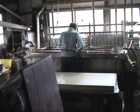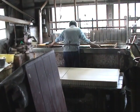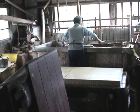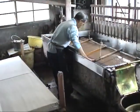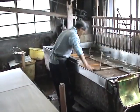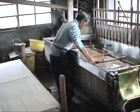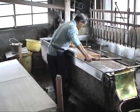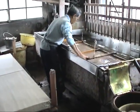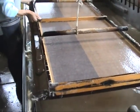Many Chinese papermakers have told me there are 72 steps in making paper, from selecting the proper trees or shrubs in the forest to the final bundling of the finished paper ready for market. In between are the myriad processes that include stripping, soaking, cooking, beating, sheet formation, pressing, drying, and finishing. The most dramatic step is the mysterious moment when a pulpy, amorphous mass is suddenly transformed into a cohesive sheet